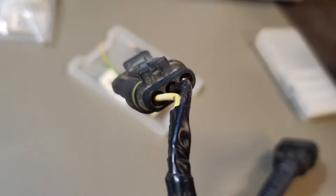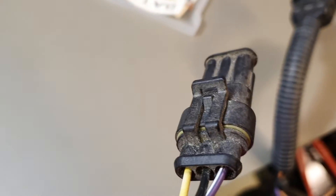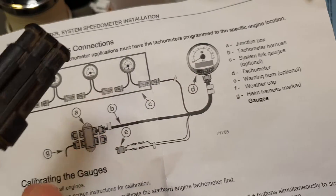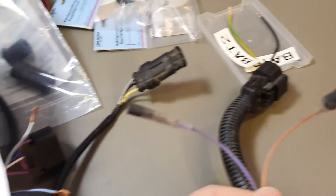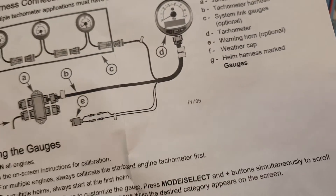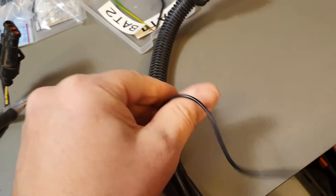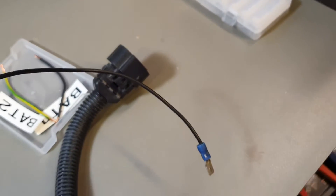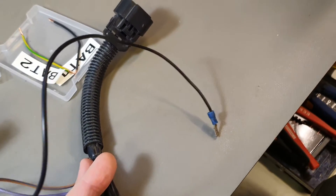The system link has a plug cover cup — you remove it, plug in a gauge, and put the cup on the next gauge if needed; they're connected in sequence. There are also two cables for the engine warning horn that I don't use. And there's another cable that I found out is for the ground — otherwise the tachometer doesn't show anything. I'm not entirely sure why it's there since I didn't record video before removing it.